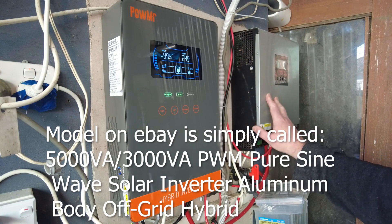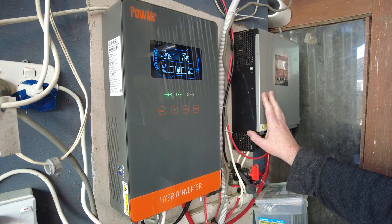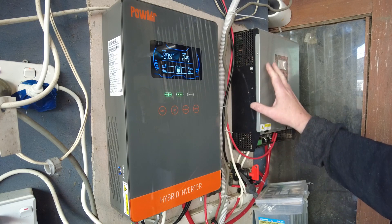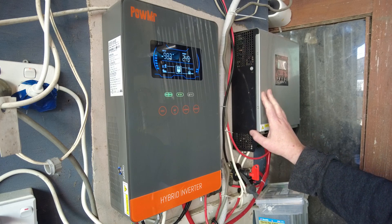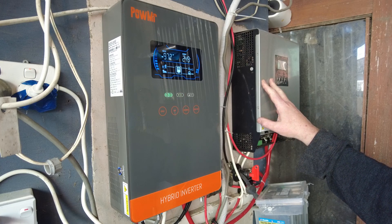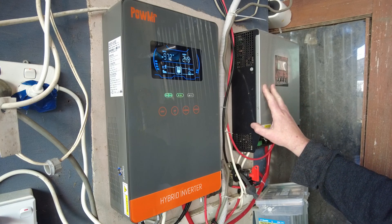This little one over here is probably about three to four years old. It's reasonably low power - it can't handle many panels. I ran four 250-watt panels off this one, and that's all it can really take because 1200 watts is the max panels it can take. It's 40 amps max, and most of my panels are about 9 amps each, so I'm limited to four panels again. With the inconsistency of panel placement, even with 1000 watts of panels going in, you'd be lucky to get 750-800 watts out. It's only 3 kilowatts, so if you had two kettles going it'll stop - very underpowered. But this is just a shed, so it doesn't have to do a great deal.